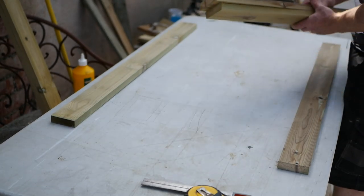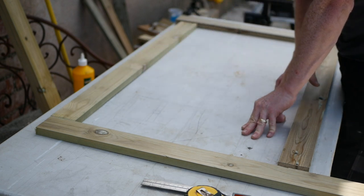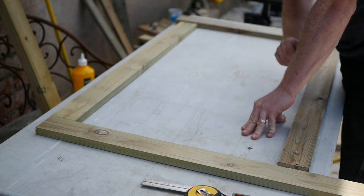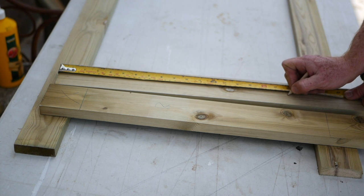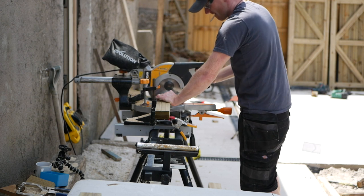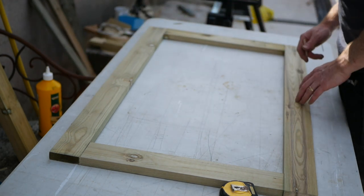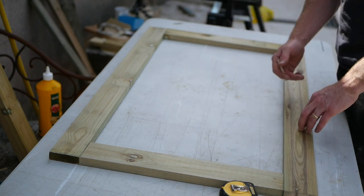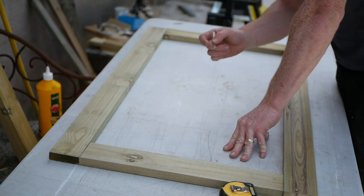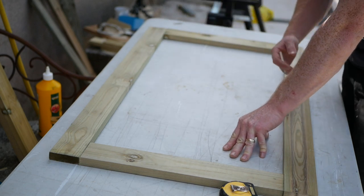What we're going to do is build an actual frame, and we'll still have our diagonal in there. That frame will then be hung in place and I can attach the pickets - because I want the pickets to follow the fence line, which I'll explain later. I'm going to fix this together using pocket holes. I know you're not supposed to use pocket holes on an exterior project, but they'll all be concealed behind the pickets anyway, so completely weatherproof.